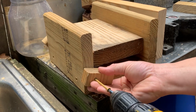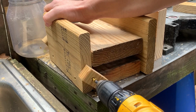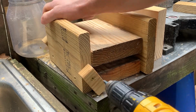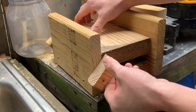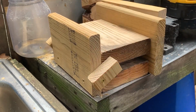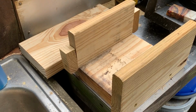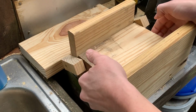Here I'm adding some little swing-away latches on both sides because when the epoxy is still in its liquid state, these will help keep the top board as well as the stack of fabric from squishing and sliding out to one side. And the reason you can't just box in all four sides is because the excess epoxy actually needs a way to escape. But these will help keep everything from escaping with it.